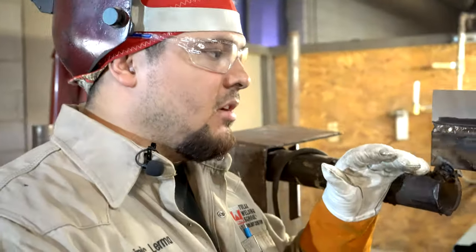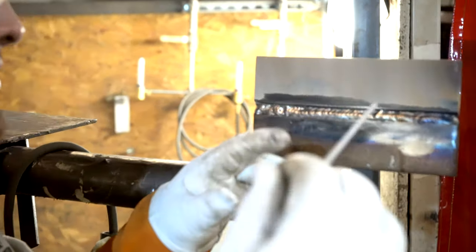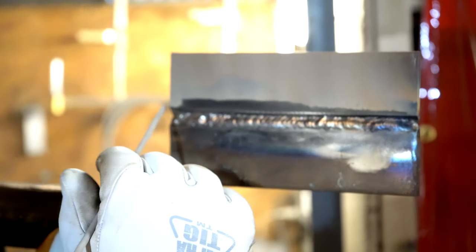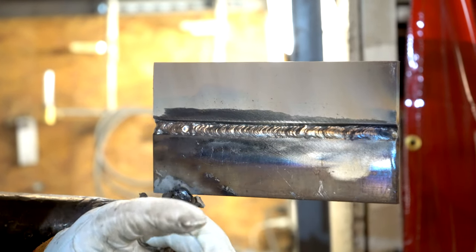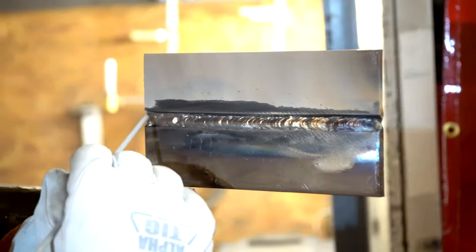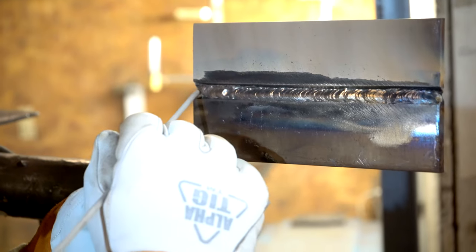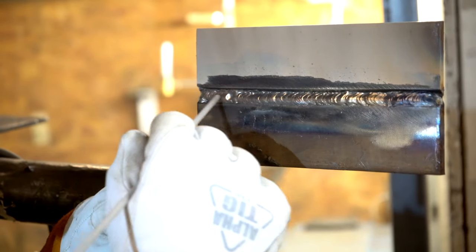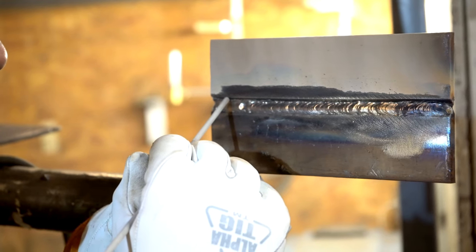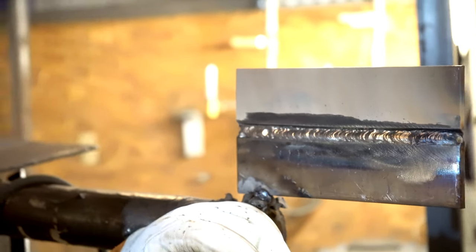All right, so now time for our second fill, our top bead, okay? So, I'm gonna do the same manipulation, right? But I'm gonna come up here on top. And as I said, for that bottom bead, same thing applies. Take care of your bevel edge, okay? Do not go over, okay? So I'm gonna come down again, come back up and hold, hold, hold, and making sure that I overlay this bottom bead, okay? That's all it is. It's doing another first bead, but on top. All right, so up, down, up, up, up. Okay? All right.